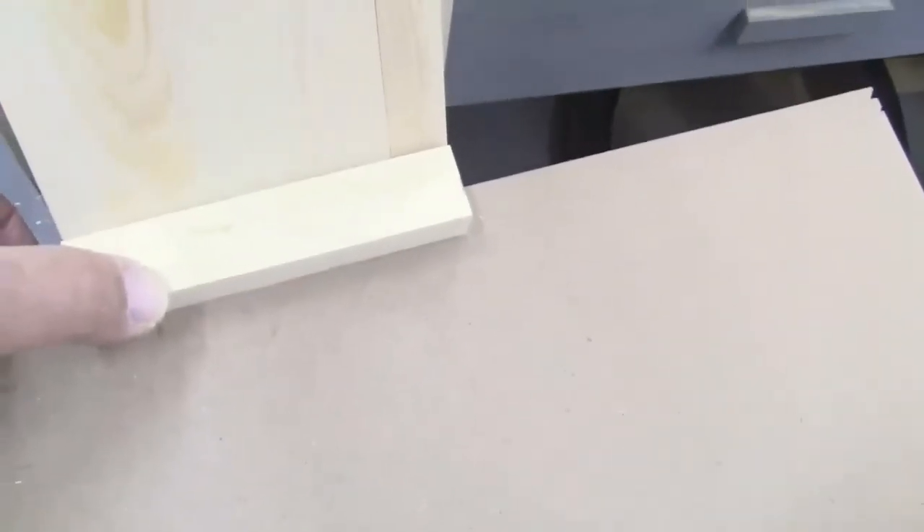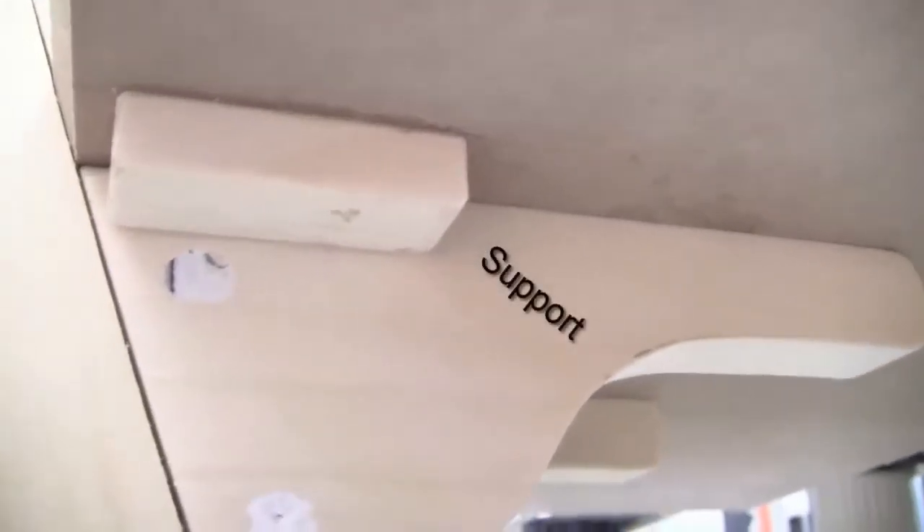Now I'm going to make a platform on which to put my keyboard. From trial and error I made it 18 by 12 inches — 18 being the width — with a 20-degree angle on the edge. But if I just leave it like that it'll come off. So I've cut a five-inch long piece of wood at a 20-degree angle and I'm going to attach it to the column so that the platform can just slide in and out. Here's the platform with the screw going into the support — now it can't move. I've placed a little stop there so when I put the platform on I just push it over to that side and put the screw in. It works very nicely.